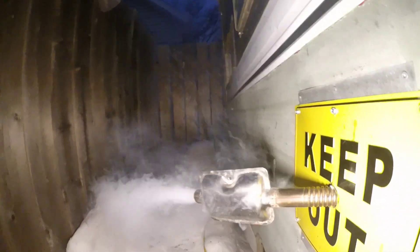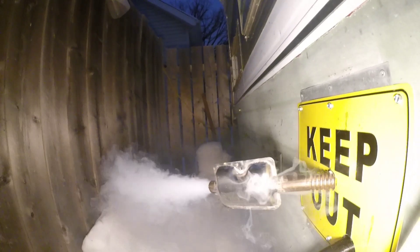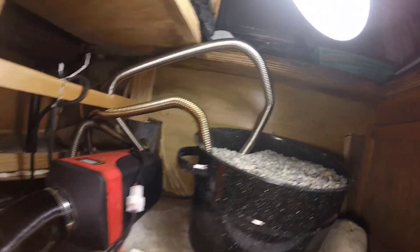It was pretty gummed up and gross. I'm still going to run the heat bag modification now that it's all cleaned up, because I still don't believe in it. This diesel heater community is by far the most toxic community I've ever been around — nothing but haters. Everyone's having the same problems with their machines coking up and nobody has any real solutions. So if you're going to get one of these, especially these Chinese knockoffs, disassemble it before you fire it up and make sure it's assembled correctly.